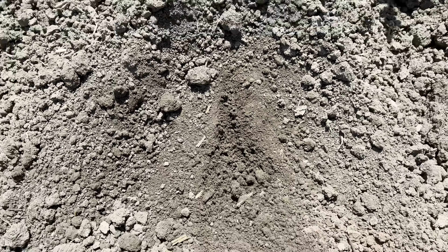You can see right here there's a lot of moisture already. After we've made the furrows, we go ahead and come with a Lilliston cultivator just to break down all those clumps and make the soil better for planting. Then we hit it with the decap right before we plant so we don't lose any moisture, and the planter itself has a plate in the back that makes the cap again, helping bring the moisture to the seed and germinate quicker.